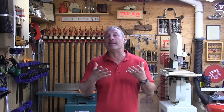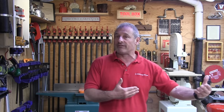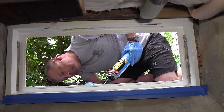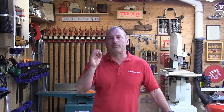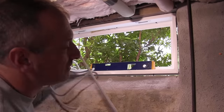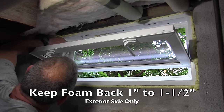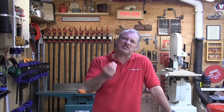Depending on the size of the gap, fill any large gaps between the window and the masonry foundation. If it's a really large gap, use mortar, brick, or stone — whatever matches your foundation material — and close in that space until you have about a half inch gap all the way around, or even a quarter inch. Use expanding spray foam under and in the side gaps, all around the window, to seal off air leaks. What I do is take some pipe insulation or foam backer rod, fill the gap on one side, and then foam to that. The backer rod keeps the spray foam from falling out the other side. You can even use blue tape on one side to keep the foam from coming out. When foaming, I try to keep the foam back about an inch or two to allow room to add mortar later on the outside — that's got to keep it waterproof, secure it, and lock it in place.